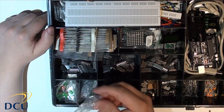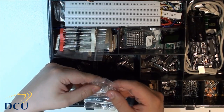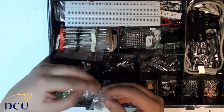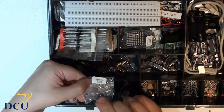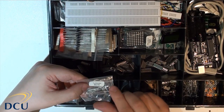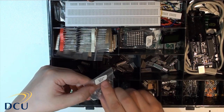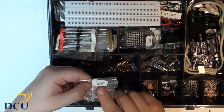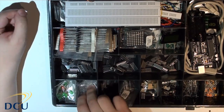There are 60 LEDs in the kit. Be careful with the length of the leg — the positive leg is longer. Try and keep them in bags because it's very difficult, especially on the clear ones, to tell the difference between the blue and red ones when they're not powered. You'll also notice there's a different current and voltage rating on each one of the components — these are 20 milliamp, 3.35 volts, and they're all different.